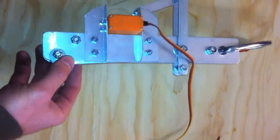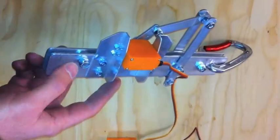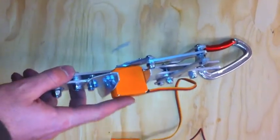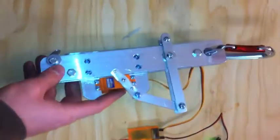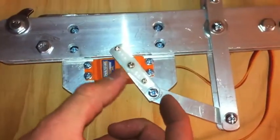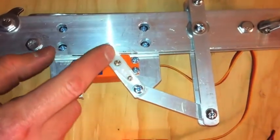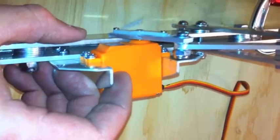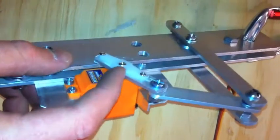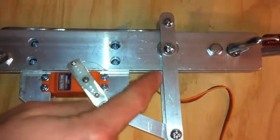So it's just screwed together in several places there. I just ended up using some angle iron instead of a solid plate — it made it easier to mount the servo. And the servo arm, you can see here, I just extended it with another little piece of this aluminum on the back side, and then it sits flush right up against the servo with nice clearance, and it made everything tie in really well without any strange angles.